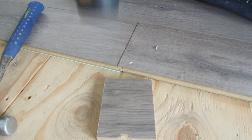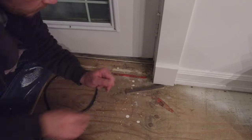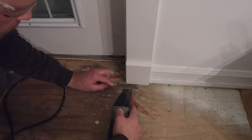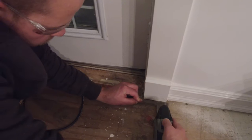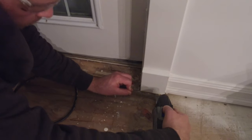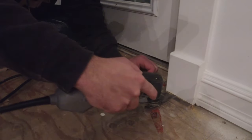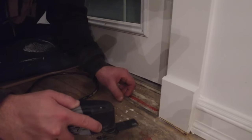When you're planning the stagger of your flooring, make sure that the boards are at least eight inches apart. Generally, you can use the piece you cut off from the previous row in the next row, but you should always measure just to make sure it's a good fit. When you come across tricky spots like going underneath baseboards or cutting notches, our favorite tool for that job is a Dremel with a flat blade. Here we have one small piece of molding we didn't want to remove, so instead we're cutting underneath the molding to allow enough space for the flooring to go under, using a spare piece of molding as a guide.